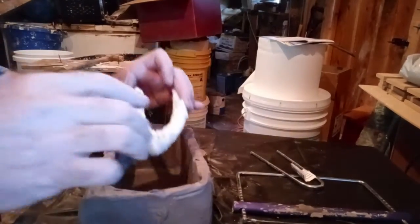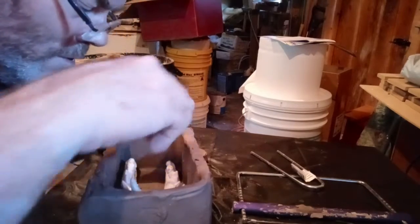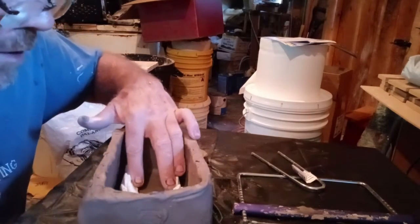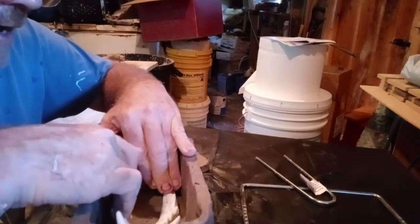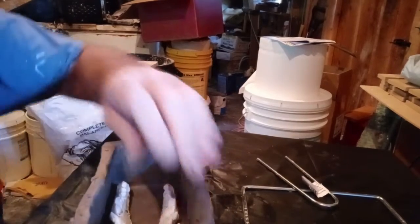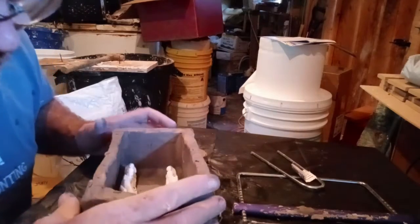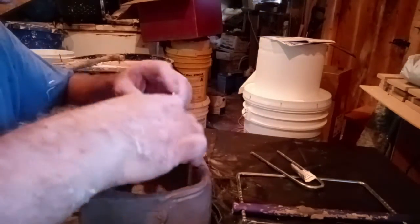Then we'll take the jaw set, put it back down in here, make sure it fits. It's got clearance on all sides. I'm cutting it a little close, making it a little bit closer than I would want it. But the latex and or silicone that goes in here will be filling up the front part. So I will not have a weak mold in the fact that this front part here and the sides have, and the back has, almost all the way the same amount of clearance all the way around. I'll turn this around. There's a weak-sided wall, so I'm going to turn this backwards and do it this way. Oops. I don't know why my gimbal is doing that.